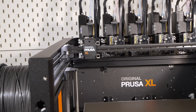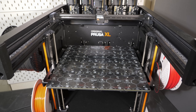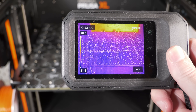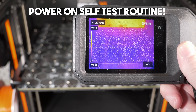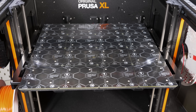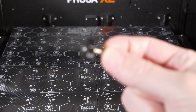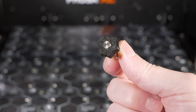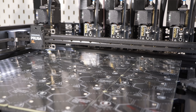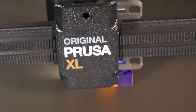All these tools have to be in alignment, and this is done automatically by the machine. Taking off the print bed reveals a tile arrangement for heating — allegedly done to limit the deforming tendencies you have with larger beds. Each tile has space to expand into, so that seems to work. For calibration, all you do is screw a pin into the centre of the bed and tell the machine to auto-calibrate. Each head will effectively poke at this pin until it's figured out the various offsets, and once it knows those offsets each head can work in turn on a single model and knows exactly where to place the printed lines.